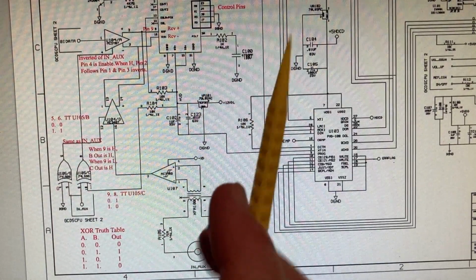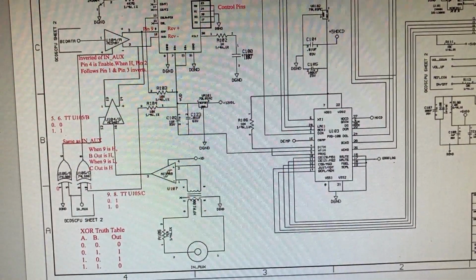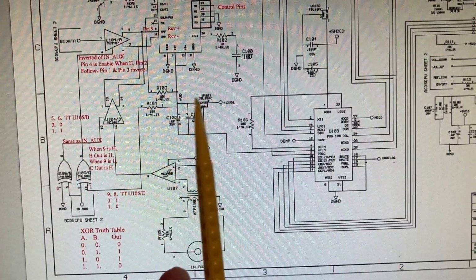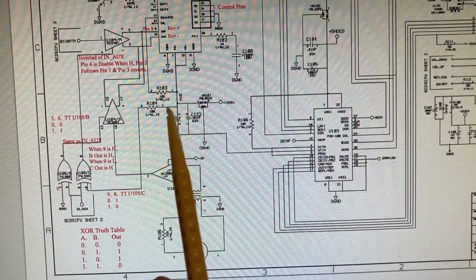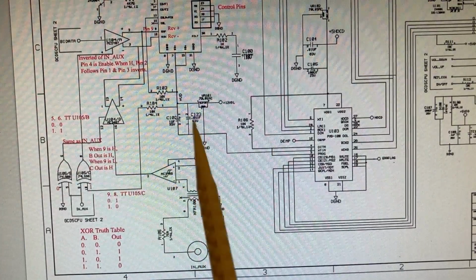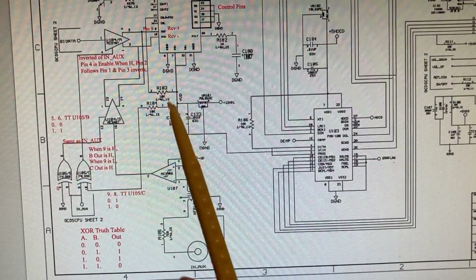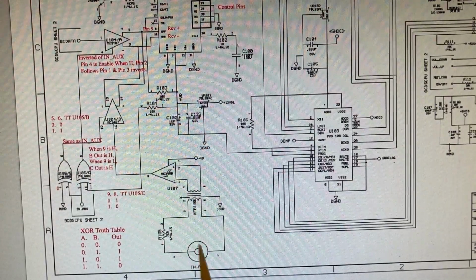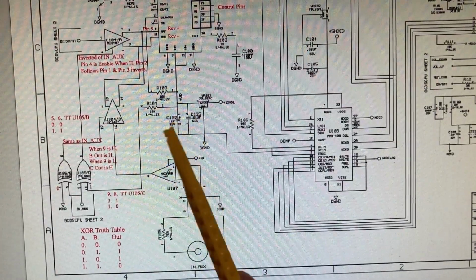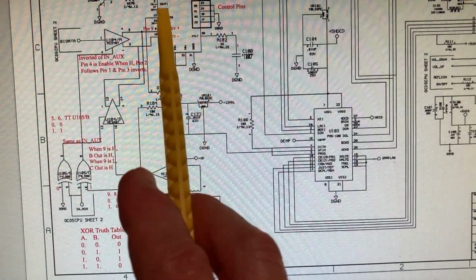That pretty much left this as a very suspect chip, U106, because that is fed directly from this regulator. Almost everything else has a nice big resistor ahead of it. For example, if the short was over on this side, we would see a voltage dropped across this 10K resistor, just like I said before with this 10K. So once we determined it's most likely not these capacitors, I started looking at this chip.